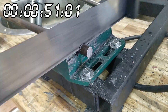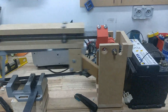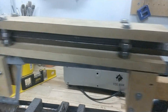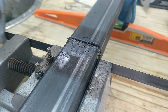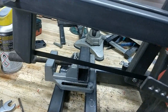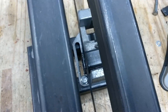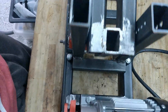As usual in engineering, you never get it right on the first try. This particular machine is my third attempt. The first one was a quick proof of concept thrown together in an afternoon to see if such a machine could actually cut through steel, but it was so poorly designed that the slider kept coming loose and I had to re-tighten it between each cut. Also, the wiper motor kept overheating and the whole thing needed to be clamped to the bench. The second one didn't use a slider — it used a lever mechanism. It would've worked fine if it wasn't for one problem: I couldn't align the blade with the direction of cut, causing the blade to fold and bend like crazy. Adding a counterweight would've also been tricky, so I ended up scrapping the whole idea.